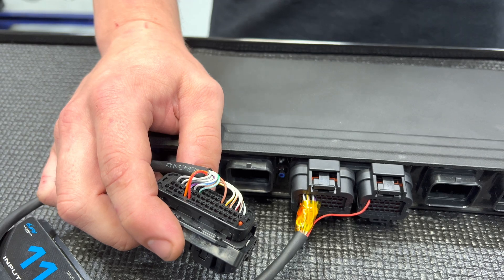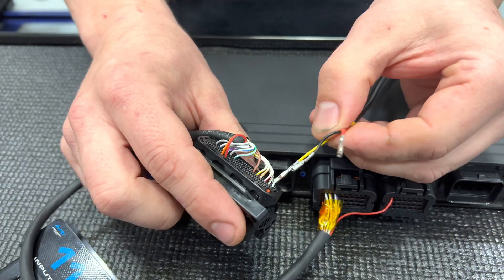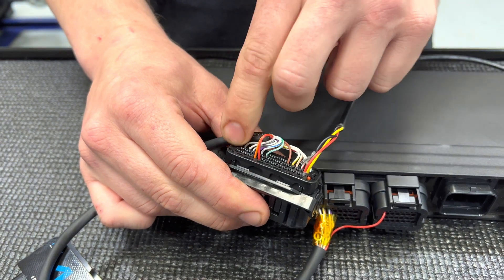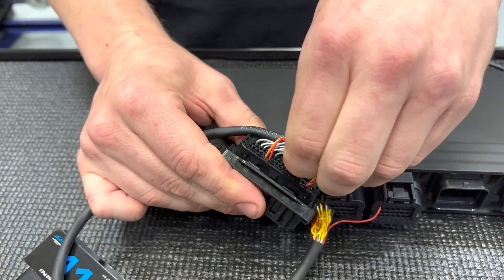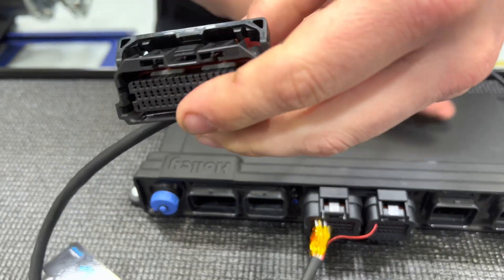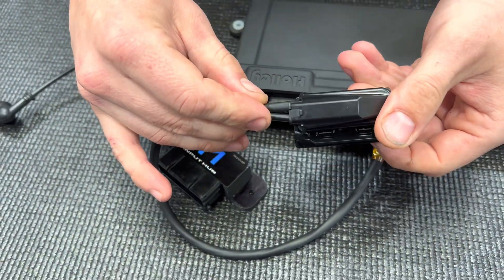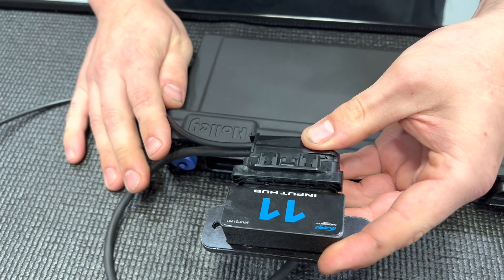All I need to do to add a sensor now is take my three-conductor wire, pick my input that I'm going to use, and then I'll need to use a five volt — so we'll do that one right above it in this row right here. And then I'll use a zero volt, which is one of the ones in the middle right there. Once that's populated, I'll lock the lock back here, orient my wires however I want them to come out, and then slide this cover over it just like that to protect the wires and make it look nice. Once that's done, all I've got to do is click it onto here until it clicks in like that — and we're good.